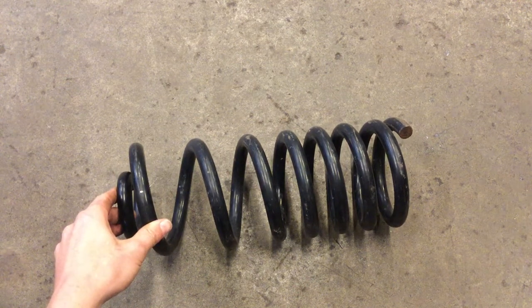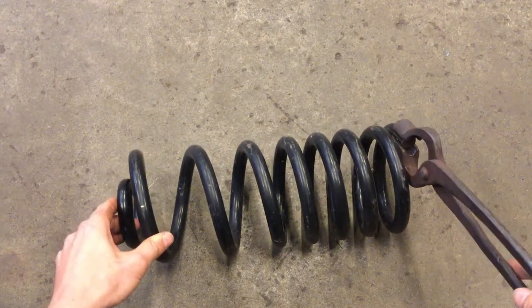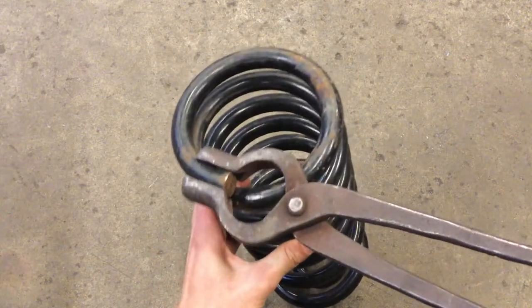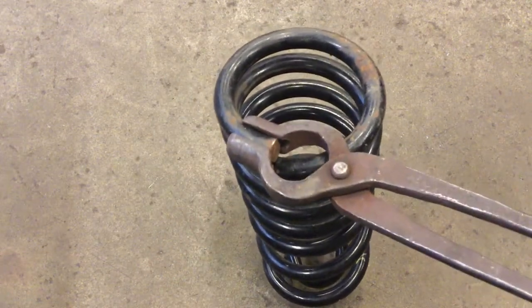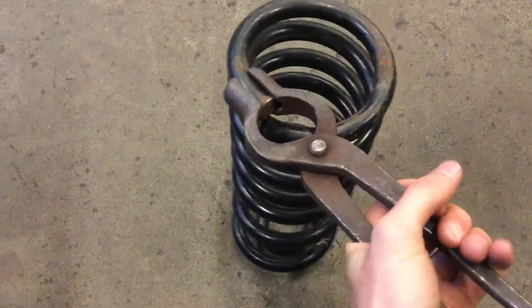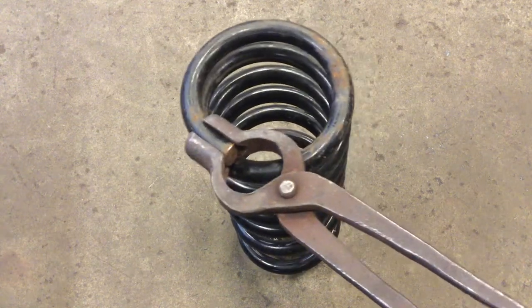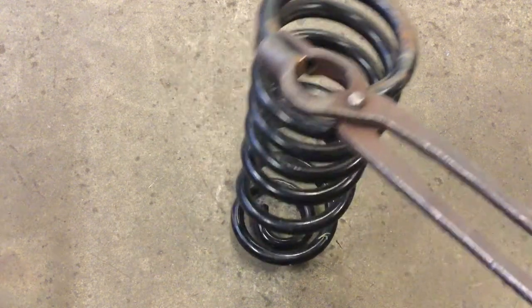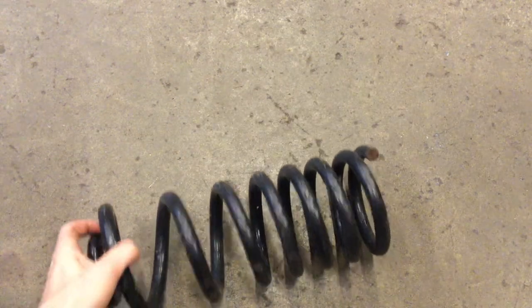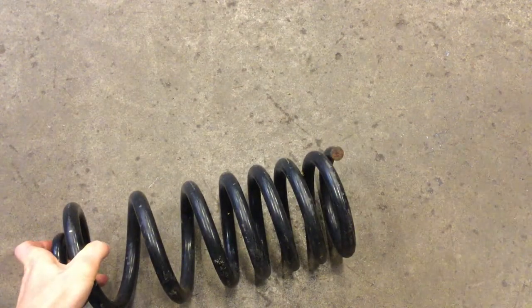Before the spring steel gets loaded into the forge, it's important to check and make sure your tongs grab on firmly to the spring and that you have a good grip. Your diameter matches the diameter of the material and you can lift freely your spring without any issue, because once it's hot, there's going to be a lot of trouble getting everything aligned if you haven't test fit your tongs, because the spring is going to want to roll in any orientation other than up or down before you first start to unwrap the helix.